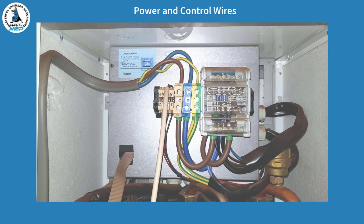When the contactor activates, it makes a thud noise. So when you flick the main isolator switch, a big thud noise is made — that's the contactor making the circuit. So if you don't hear that thud noise when you make the main switch, then the contactor has failed. You'd have to make sure there's power across live and neutral, and if there is and that thud noise is not heard, then the contactor has failed.